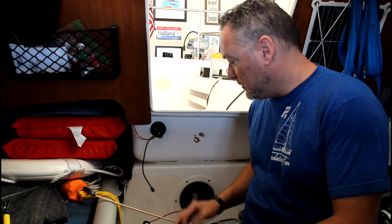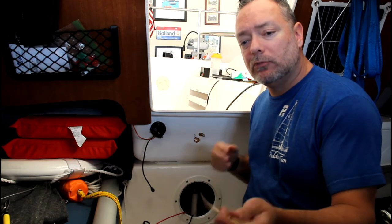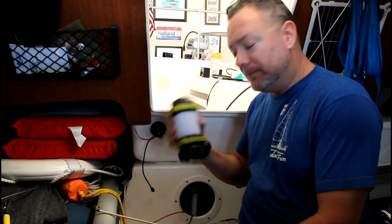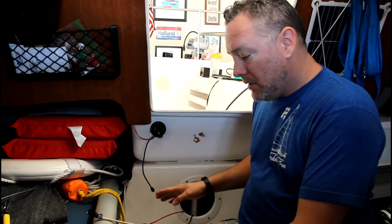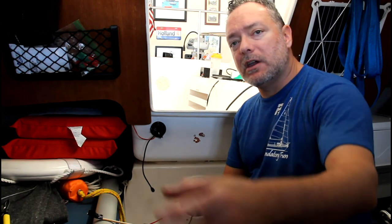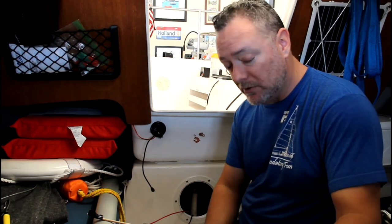If you're wondering how I ran these cables, the tools I used were about 12 feet of copper cable, a 30-inch, 2.5-foot dowel with a little bit of duct tape at the end, an inspection mirror, and a lantern. So the way I did this, I ran from the inspection port I installed in the bow to here, by stringing the copper cable down under the bunks, and I had a problem because it kept coiling up. It would go about maybe 2.5 to 3 feet in and then just start coiling up in a big empty space underneath the bunks between the hull and the liner.